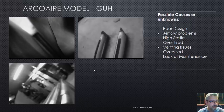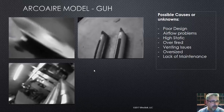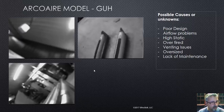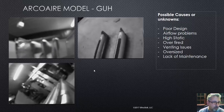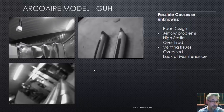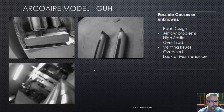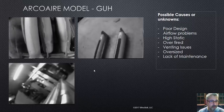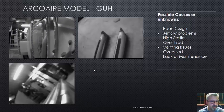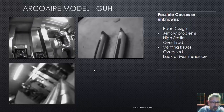Watch for those fractures — that's a major fracture. That furnace should not be in operation at all. The likelihood of getting carbon monoxide out of that furnace into the airspace is probably slim, but I would never leave that furnace operating as a technician. Absolutely not. That thing would have been shut down. I usually turn the gas cock and shut that off.